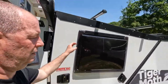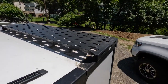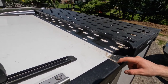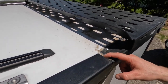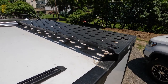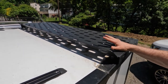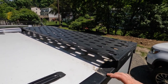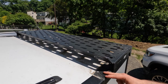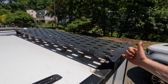Alright, let's get up here — put a little step there. So if you guys have seen the other video, I got up here in the rain and saw a little water swirling here. So I cleaned it — of course it's dirty again — I caulked it really good. While I was doing that I also removed the basket, sealed around all of this bracket, and before I put the basket back on I sealed all the holes where the bolts go through.